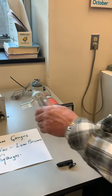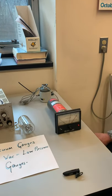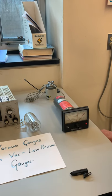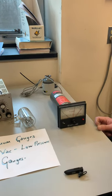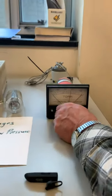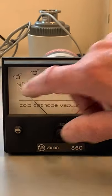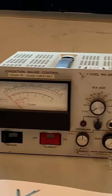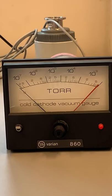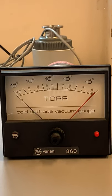That terminology explains the name for the other approach: a cold cathode gauge, also called a Penning gauge. Cold means it has no filament. A cold cathode gauge goes from 10⁻³ down to about 10⁻⁷, whereas the ion gauge goes to 10⁻¹⁰. This limited range is why Penning gauges are often used on mass spectrometers, and the key advantage is there's no filament to burn out.